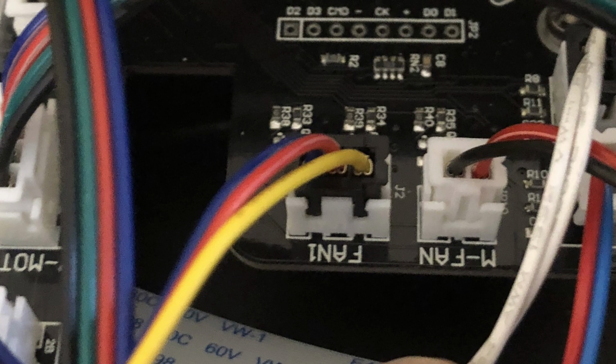And all you do is you buy an electrical hour meter. They're on eBay, Amazon, AliExpress. They cost between $8 and $16, depending on if you want it really quickly from Amazon or if you want to wait a few weeks from China. And I had to find a place to attach it. So there is one fan on the hot end that turns on when the hot end goes above 60 degrees Celsius, and it turns off when it's powered down and cools down.